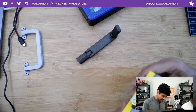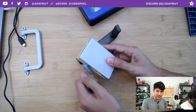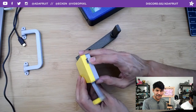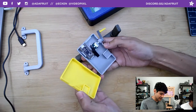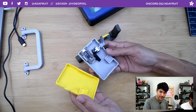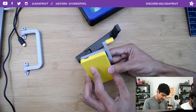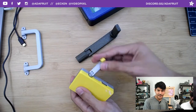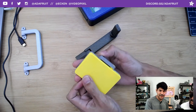So, if folks want to build this one, it's a USB HID device, so I use it to scroll. All it does is a mouse scroll. It's running CircuitPython, and it's an Adafruit Itsy Bitsy M0. That's all that's wired to it, just a couple wires here. Really, really simple. So if folks want to make a crank, feeling cranky. We got some votes that people want to see that layer by layer. Me too. Oh, I forgot, this clicks in too.